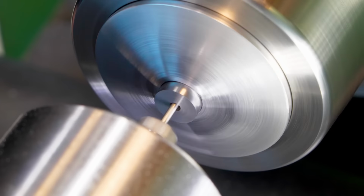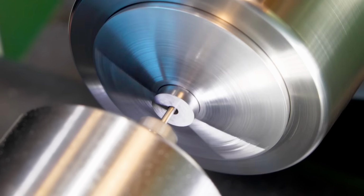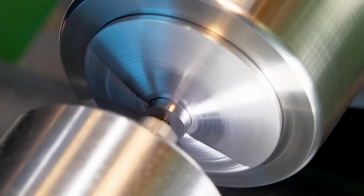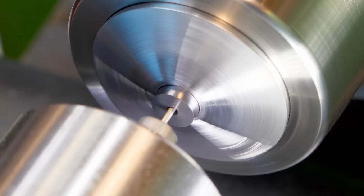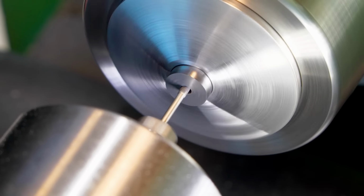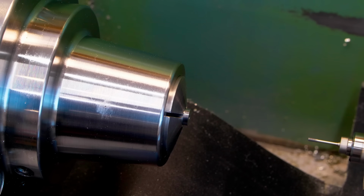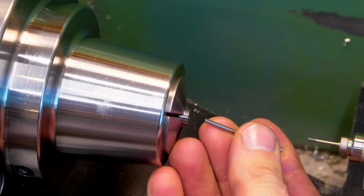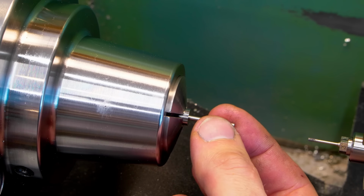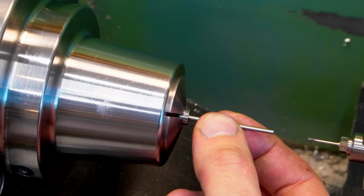On the rear end, I have to use the DRO on the side that's facing towards me so I can see it. I can just eyeball it. If you go outside of the bore too far or completely with the grinding tool during the ID grinding while you're stroking the entire length of the bore, there is a high probability of bell mouthing the bore because you suddenly lose the pressure on the grinding tool, and then you end up with a bell-mouthed contour, which we don't want.